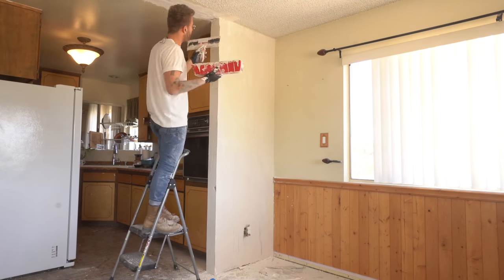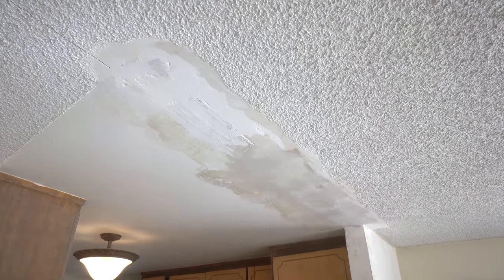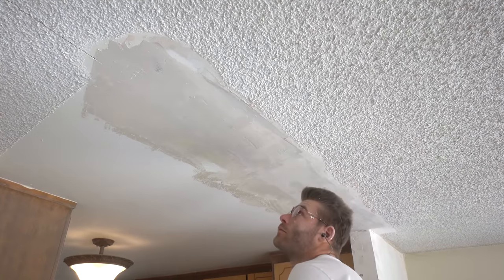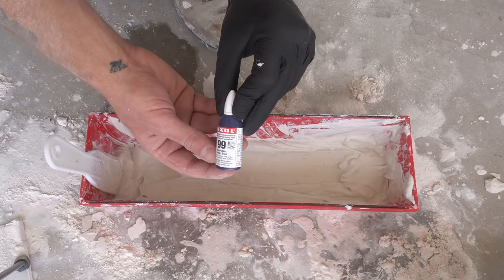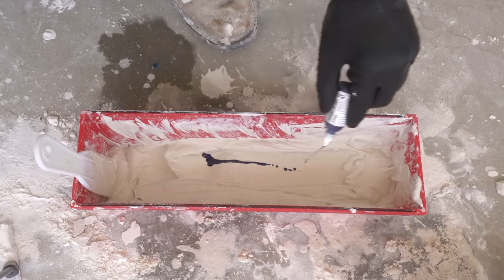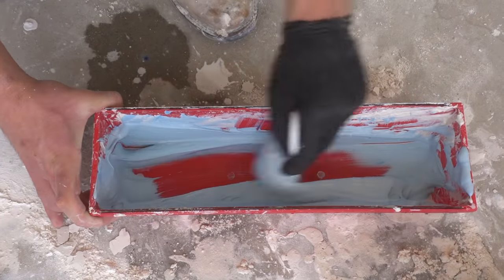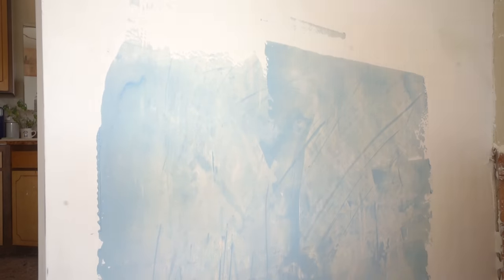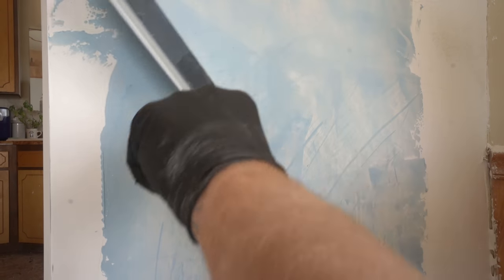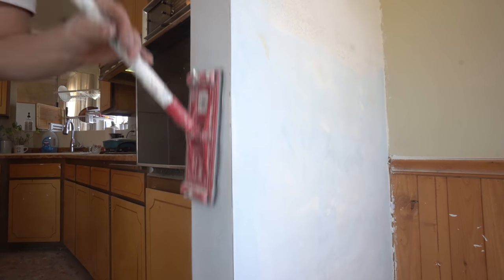I didn't really build up over the paint — I just made sure I had a smooth texture over the existing one. Then all I needed to do was backfill any of the negative spaces I had in the ceiling before I sanded this second coat down. You can see here I put it on a pole, that way I could sand everything faster with a little bit more pressure. I added some blue pigment into the third and final coat of our joint compound before I applied it — this is going to help during the troweling process to see what I'm backfilling more easily, and it's going to highlight everything I need to sand down. For reference, I've been using a 12-inch drywall knife for the past two coats doing this skim coat, and that works great because it's got more of a reference surface to make things flat. I used 150-grit sanding nets on the first two coats, and then on this final coat I sanded everything down with 220 grit, so it was really smooth.